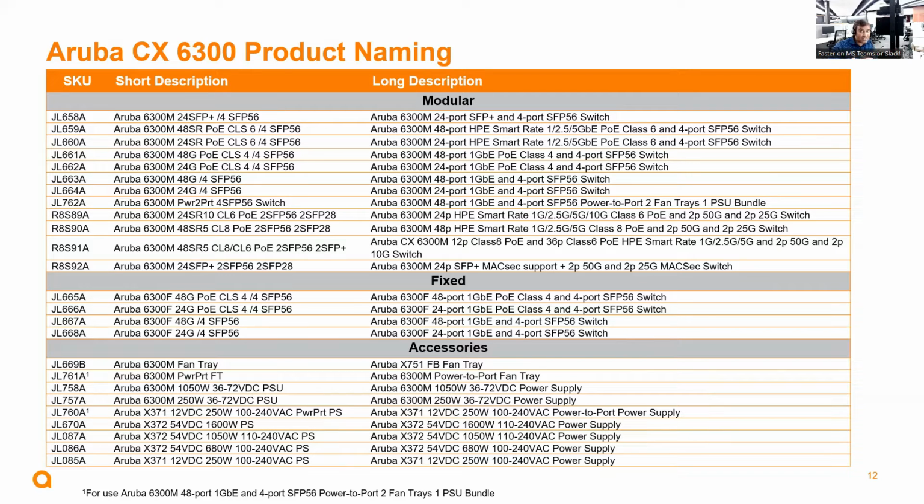And moving to the next biggest part, that is the ASIC, right? I can talk for hours and hours because I'm coming from an engineering background. I understand how these ASICs are built before they are sent to a fabrication house like TSMC or Micron. Micron, you might know, if you are using a mobile, all memory comes from Micron or from Samsung, right? Similarly, all the ASICs which we develop, especially on the 6300 platform, are our own ASICs. We do the complete engineering in-house. The RTL design happens inside Aruba. We complete all of that, and then for fabrication, we send it to somebody who is trustworthy currently. So that's what we do, and we get the fabrication done.